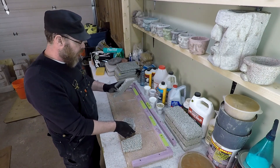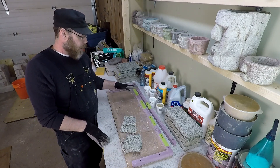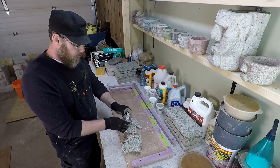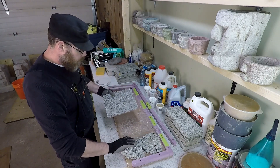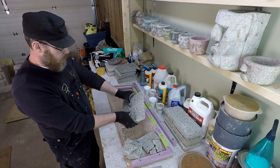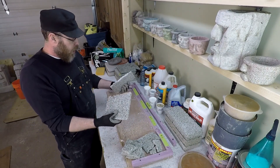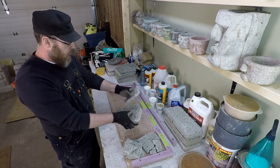That kind of failure is exactly what chopped glass fibers, fiberglass, and maybe some PVA in the mix would help with — this is nothing except Portland cement and perlite and it's just super weak. Breaking the four-to-one brick for comparison: it definitely took more force. The eight-to-one gave as soon as I pressed; this is twice as strong, if I had to put a number to it.